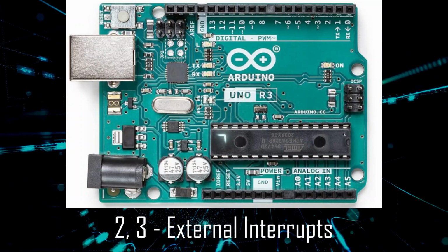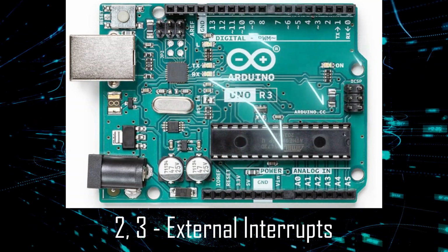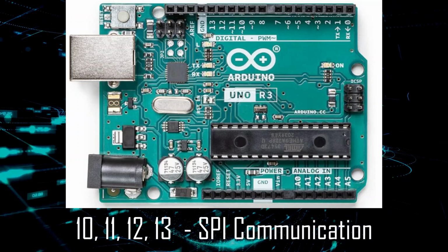Pins 2 and 3 are external interrupt pins, and pins 10, 11, 12, and 13 support serial peripheral interface communication when using the SPI library.